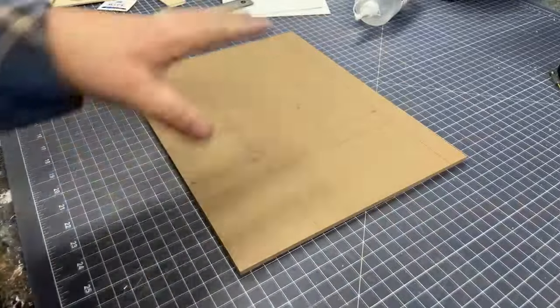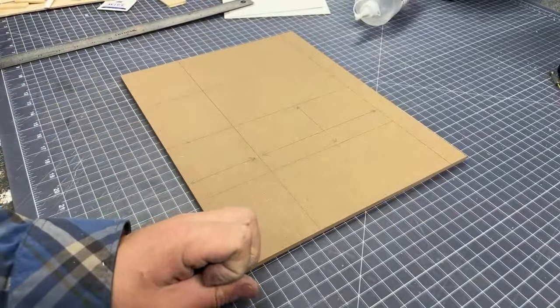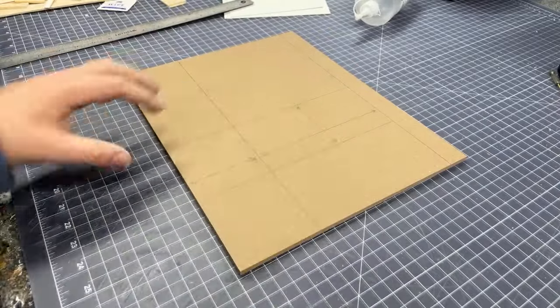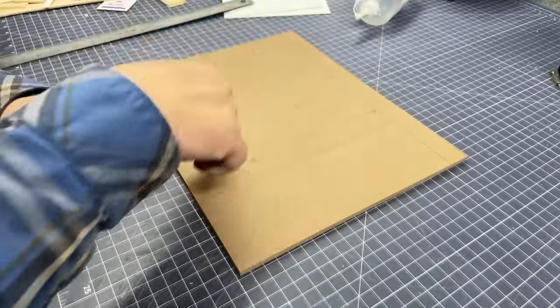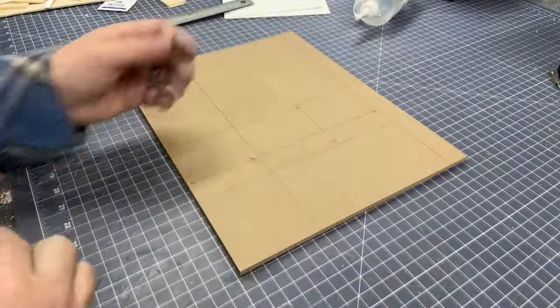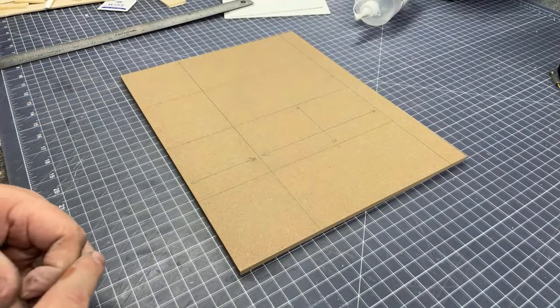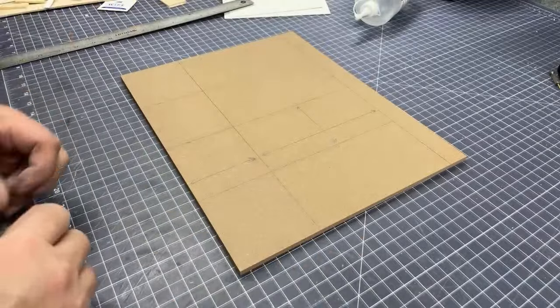But all of this comes from my technical drafting, working backwards from the simplest measurement or the simplest way to lay it out, especially if I'm trying to decide as I'm going. Finding center lines or center points of circles, center points of arches, drawing out from there and working backwards on the math for how you want to lay it out is usually the fastest way to get measurements that you can use to cut stuff.